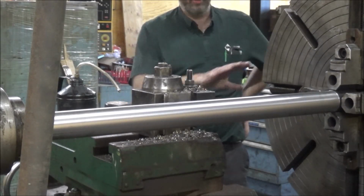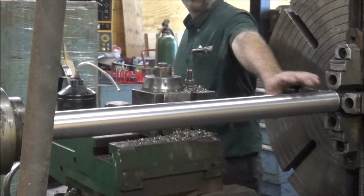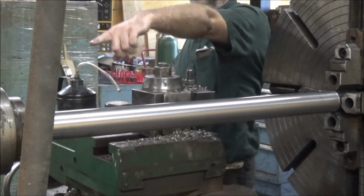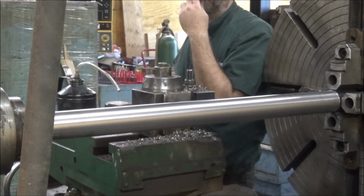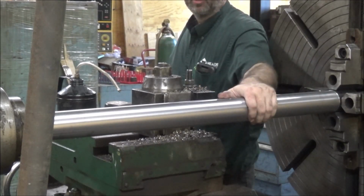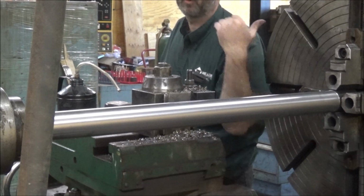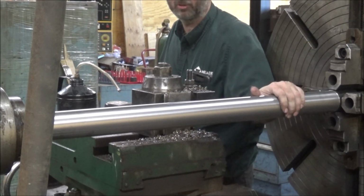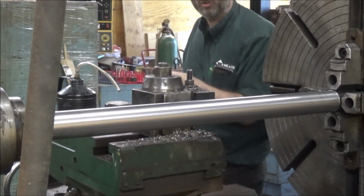All right, so I've got this thing cut in here, and it's had a chance to mostly cool down and equalize. Still a little warmer on that end. I am going to have to try and take the bearings apart in that tailstock because it runs warm. So I need to try and do something with it. But let's see how this thing will cut. So fire the lathe up, and I'm going to try and take just the smallest amount I can to put the least heat in it. And we'll check and see what kind of dimensions I'm getting.